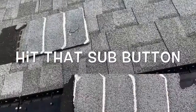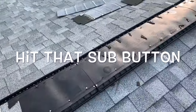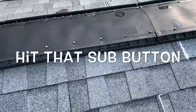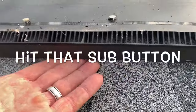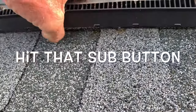Look at this — this goes on here like this, this is a cap on a piece of plastic. If your roof is leaking near the ridge, it's not going to be because of the caps. It's not going to be because of your ridge vent — it's probably going to be because of the way it's installed. Look at that — water just blows up under there and right into the house.